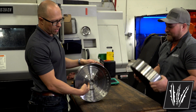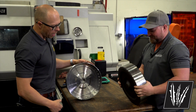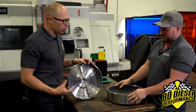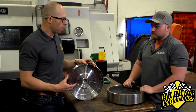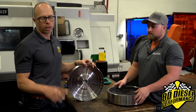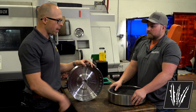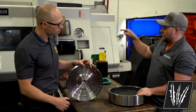You can see the dramatic weight reduction from the forging. With the forging, you get that unified grain structure and also a material reduction, which saves on machining cost while optimizing strength. All their torque converter covers are machined here in the lathe department — whether it's for the Allison, 68RFE, 47, or 48 — they're all machined right here.